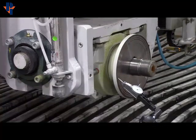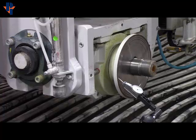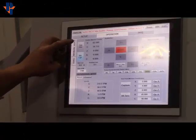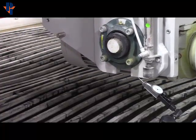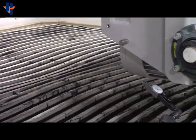This is the Flange to A. Make sure this flange is all the way up against the arbor, nice and tight. Use the slow button, Y negative, until you touch. Then use the one thou with Y negative to get to zero. There's no need to sweep on the flange because it's already flat. Once you get zero, hit user zero and drive to the back pin — that'll clear all these values out. Use X positive and then Y negative to get to the back pin, being sure not to hit anything on the way.